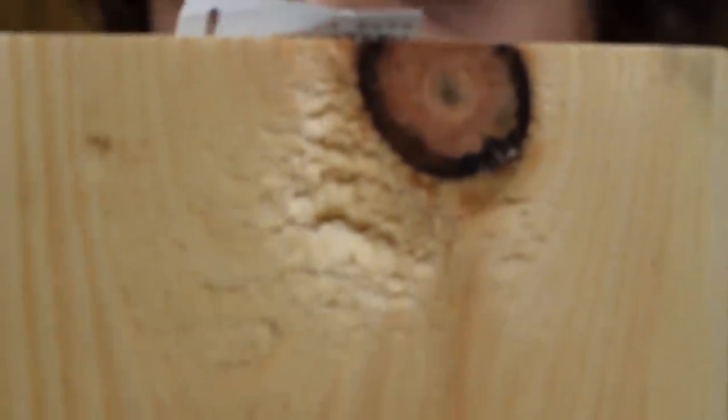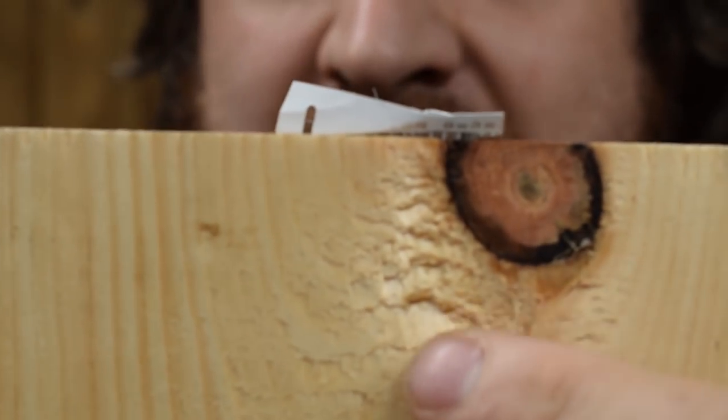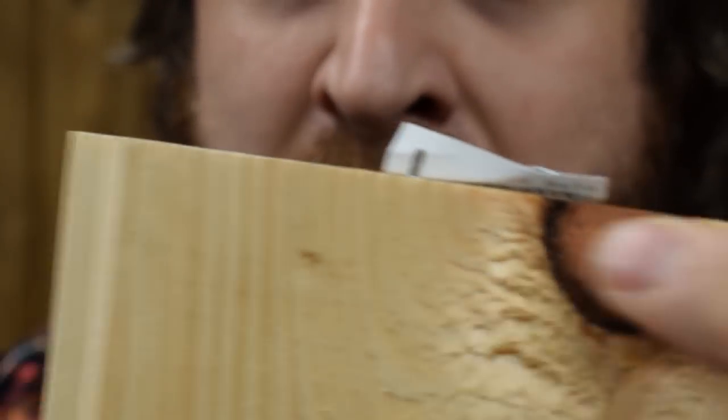I also lost the entire finishing process — how I sanded and stained all the door boards. Quick rundown: I have a cut-off piece of the board here. These boards were not in the best shape — pretty rough and divoted and choppy. So I used my random orbit sander with 80-grit sandpaper to really chew down the rough spots. My last door I just did 220 sandpaper and threw the stain on, but these ones were really bad.